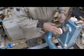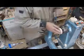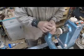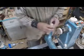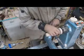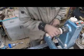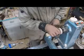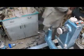And I'm thinking, because I'm drilling a 3/8 hole in this, I want to have enough meat around here so that it will glue in there and be strong enough. I'm thinking that 1/2 inch would probably be too small, but a 3/8 hole in a 5/8 would give me an 1/8 on either side. That might be enough. Let's see how big this is.